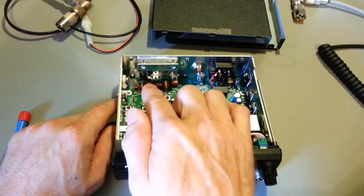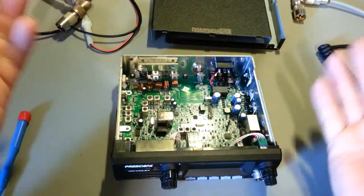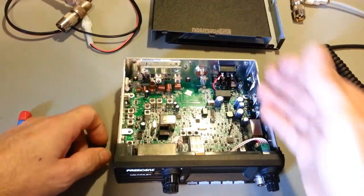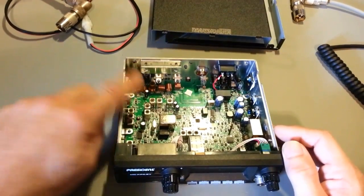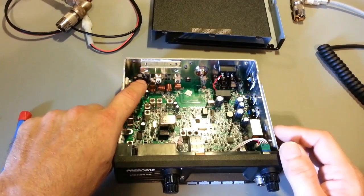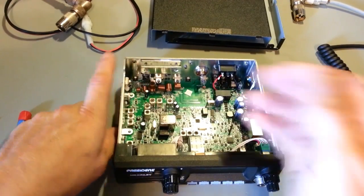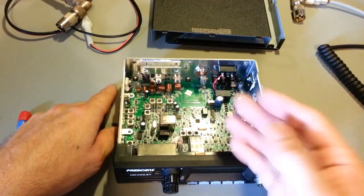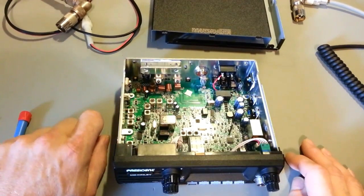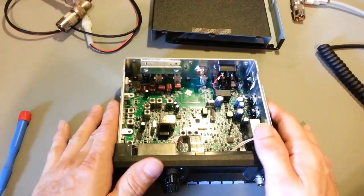That tells me, as long as this thing doesn't take a lightning strike or really high static through the antenna, this final is probably going to be very durable, because that's actually a fairly high power final. Set this thing up the way it's supposed to be, 4 watt AM, 12 watt sideband, and that thing should outlast you and me. So yeah, I think that's really good.